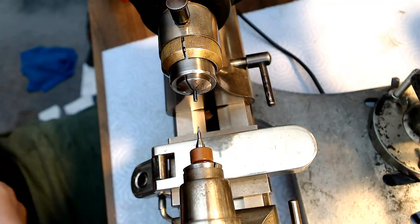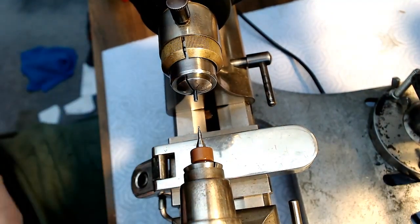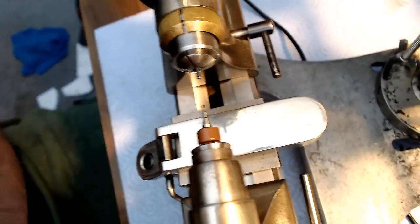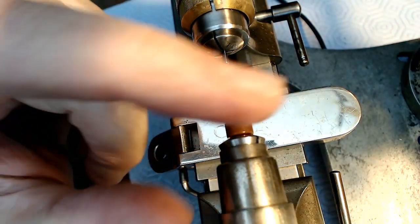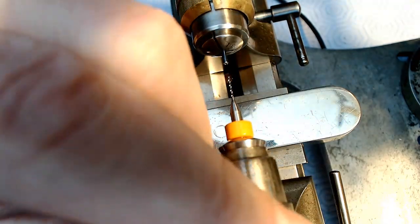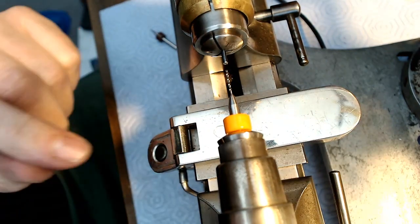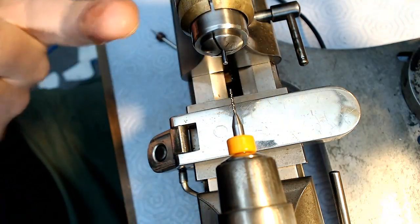Alright, now I have to switch this out, just to show you what I got for like a millisecond. There, I'm just loosening that up on top, and this is a micrometer on the end, right? So loosening that up and then prepping it, hopefully that's in focus. Yeah, I think it is. And then removing the bit and putting the other bit in. So this is the appropriate sized bit, but if this breaks off, I'll just flatten the end of that bit and use that. Tighten that up, loosen this on top, and then see if I can cut in, because it's always good to use a smaller drill bit anyway to get it in there nicely. A lot of cutting oil.